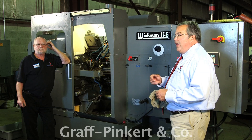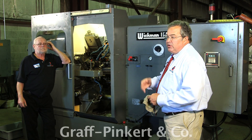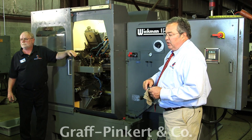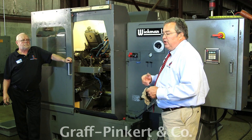The way to stop the stringer is to stop the feed, or peck drill - a common term people use. They drill and back out, drill and back out, drill and back out. There are a lot of systems commercially available in the market for drills with air motors that actually offer a peck drilling feature.